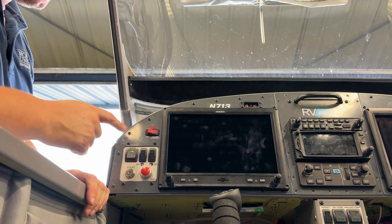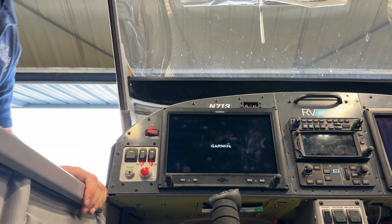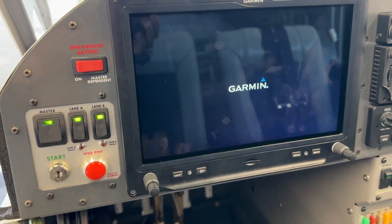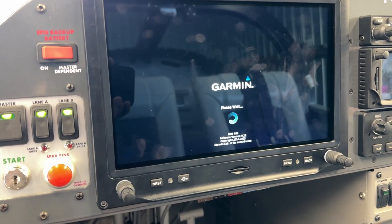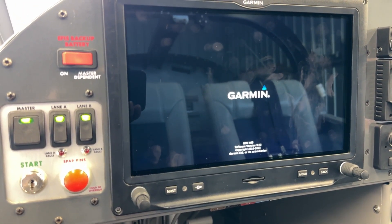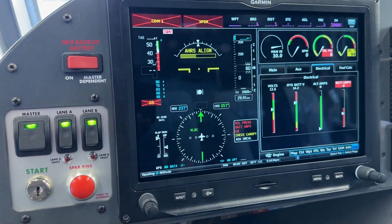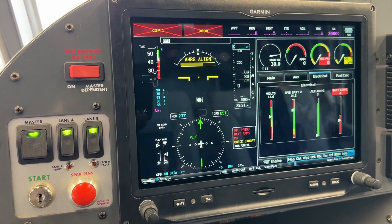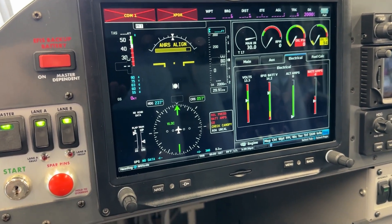The service letter is done. Now we're going to power on and wait a minute to see if the bad behavior has been corrected. Master on, lanes on, fuel pump on. Hopefully we still have the same battery voltage level as before to do a true test. That looks about right — 13.6 was definitely over the threshold that was set in the old firmware.